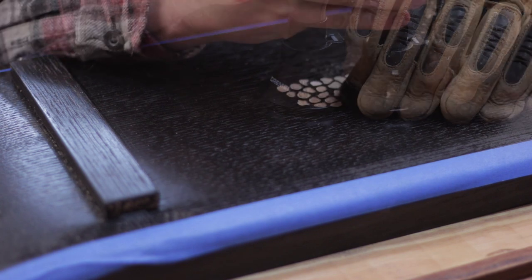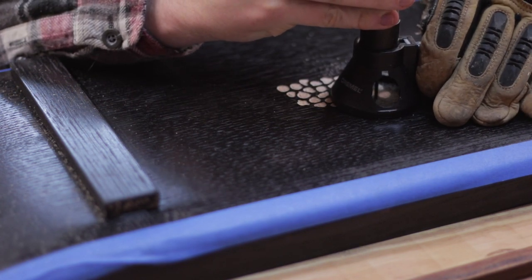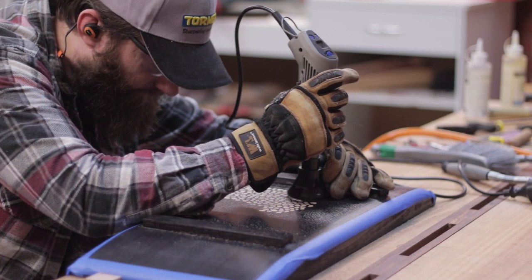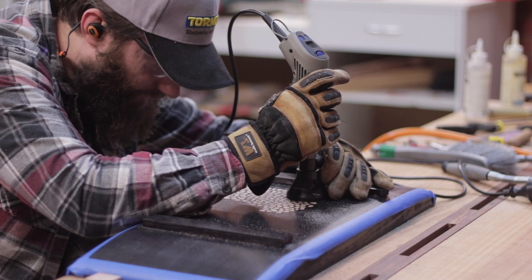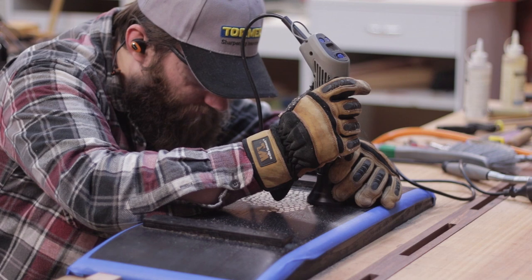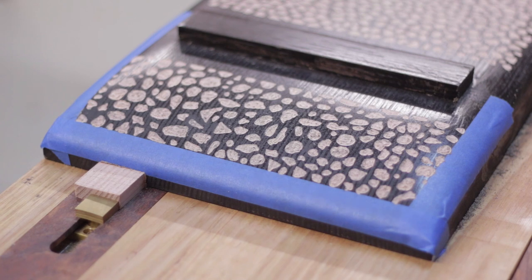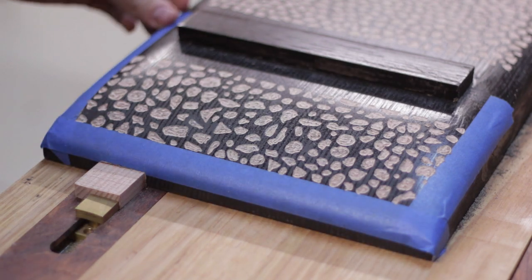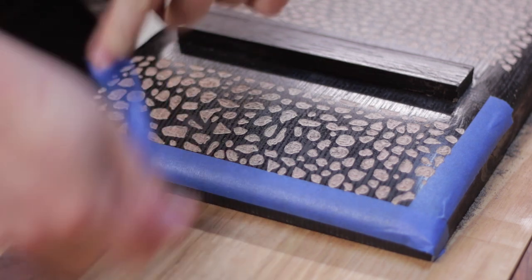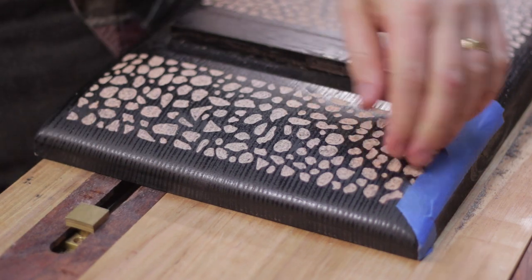Did I mention I used a Dremel? I tried to use the die grinder, but unfortunately my air compressor just couldn't keep up and it left the die grinder — flaccid. This process was a lot of back and forth, and that was before I even got to the hours it took to carve into the underside. Finding the right RPM and the right bits took much longer than I thought it would. For reference, 14 on this particular Dremel is about the right speed, and I used a ball end mill, though I suspect a spiral down-cut bit would work too. Either type of bit results in very little tear-out.